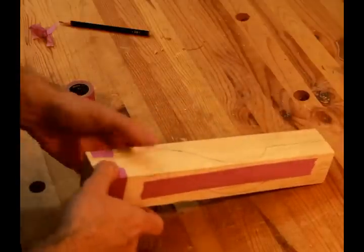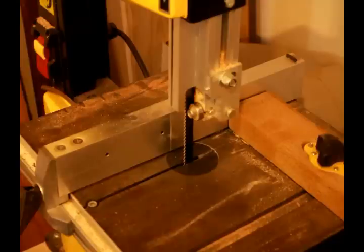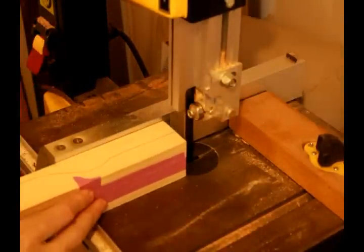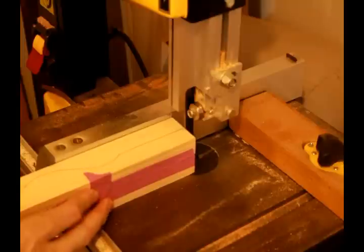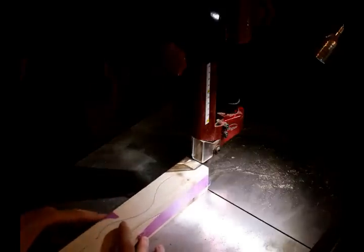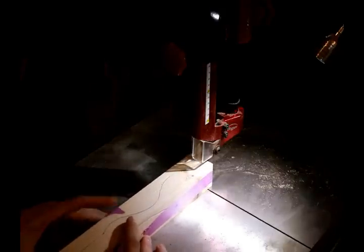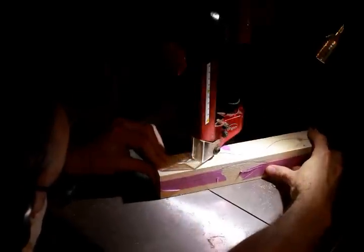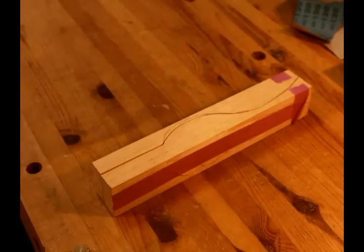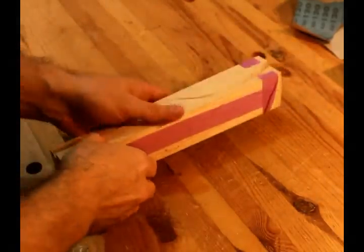After I've done this, I go back over to my bandsaw and I cut the other straight portion of the leg at the top. And again, if your legs are totally curved, you can just skip this part. Then I bring it over to my other bandsaw and I cut the rest of the curve like I did earlier. Again, I'm cutting 2 legs, so you'll see both get cut here, I think. Oh no, just one. My mistake. So now I have it cut twice on adjacent sides.